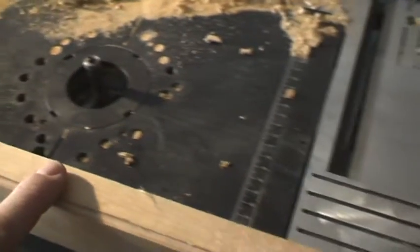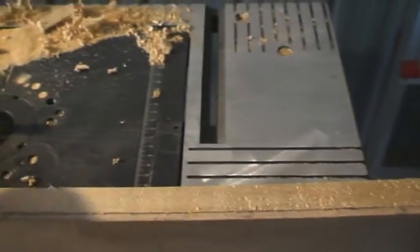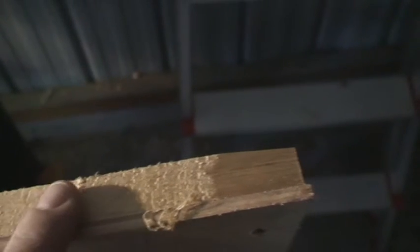Here's our piece of wood, cleaned up as you can see. Got quite a nice cut on the side, as you'd expect, because we're basically rolling down the grain. As you might have sort of seen going on the other side here. Up at this end we've got quite a nice wood looking okay. When we get into the middle, we've got the grain basically coming through and rising out here, so that the router going around this way has left quite a rough surface along here. That's alright, and in fact it's actually chipped out at this end here.